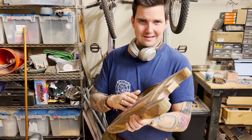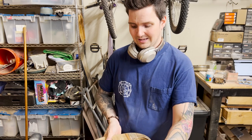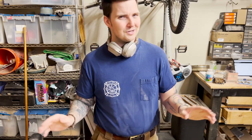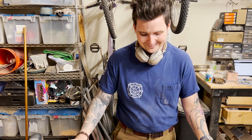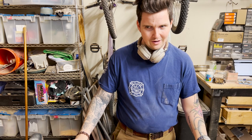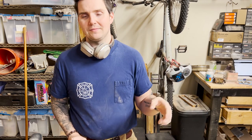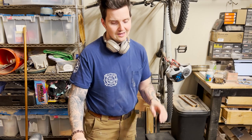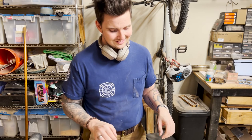But nitro has that magic juju. It's what everybody used back in the day, like the old Les Pauls are finished in nitro and stuff like that, so there must be something to it, right? I digress, but I'm not gonna get into that argument right now. So we'll do poly. All that's to say, progressive sanding, I usually start about 150 and I'll progress to 600, then I'll start doing my finish and color, and then I'll get it up to 2000 or 3000. And then we go into polishing and buffing, which is a whole other talk.